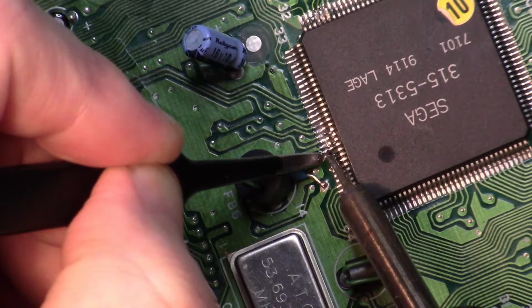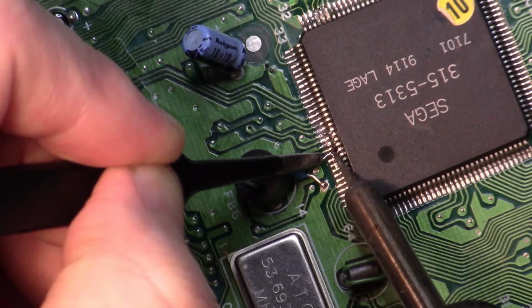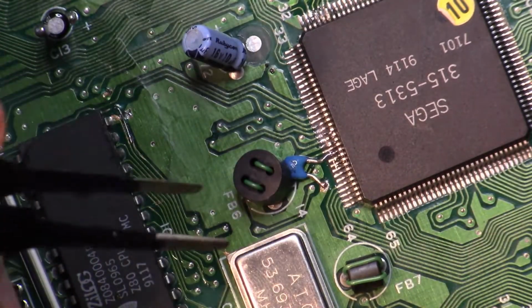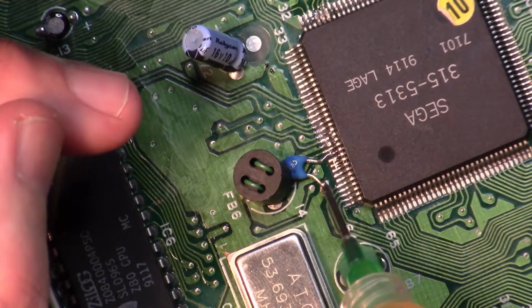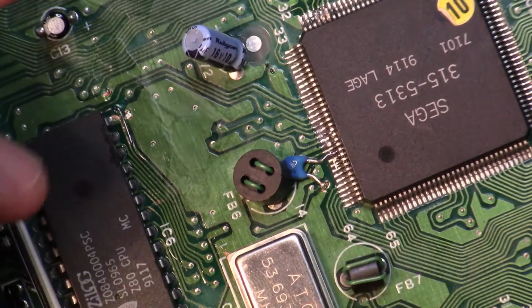The largest capacity ceramic caps I have are 220 nanofarad through holes. Most installs I referenced used 4.7 microfarad surface mount MLCC caps, but I decided to just go with what I had at hand rather than wait around for parts to arrive.